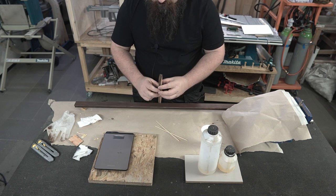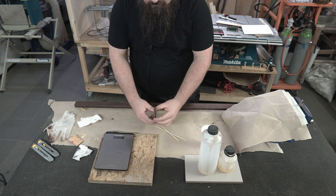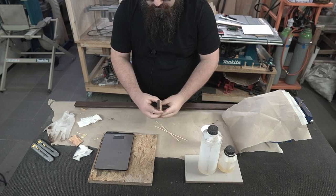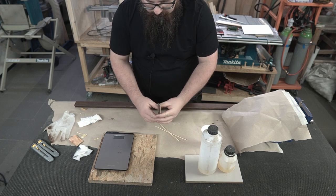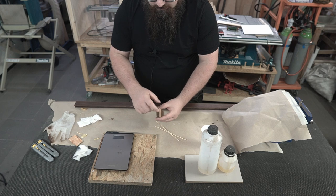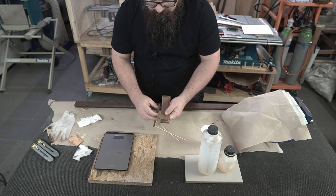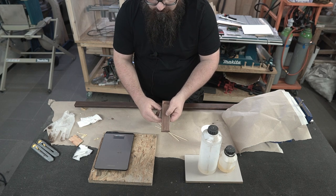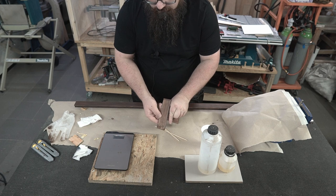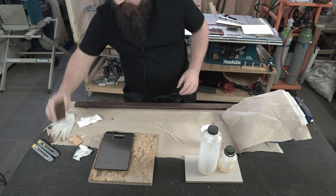Yesterday I was talking about using wood glue with water to seal end grain. Here you can see two end grains, and I guess it's pretty easy to guess which one was sealed and which one wasn't. Here is the raw wood — it's way darker. Here is with glue — it's way lighter. And when I put them side by side, there is almost no difference. With the raw wood you can see immediately that it is darker. It was stained just once, so a second stain would make the difference even more significant.